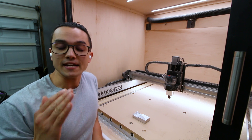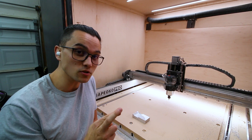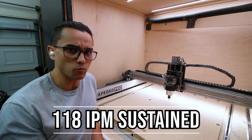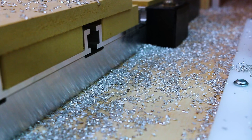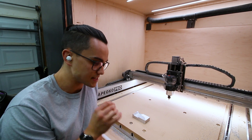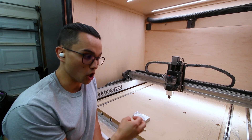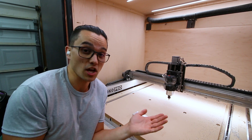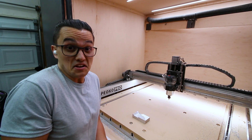There you have it guys - it cuts aluminum and it does so beautifully. I'm going to be honest, I'm completely surprised by those results. I'm pretty sure I got over 100 inches a minute in aluminum, no problem, and it was just flying through it. So I'm really optimistic that this is definitely something I can cut going forward. The chips for this entire process look gorgeous - a bunch of really small little C's or sixes or nines. That chip is carrying away all of the heat but is not going to clog my cutter - which is almost impossible with a single flute - or get wadded up into a giant ball. All in all, completely successful machining. I feel really confident with that recipe. I'm genuinely surprised because this is not normally how my testing goes - this had none of that. It just did the thing.